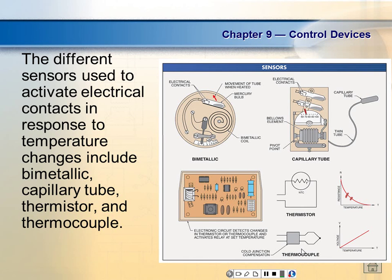Gas fireplaces work the same way — anything with a pilot light will have a thermocouple. If the pilot light goes out, the thermocouple stops generating voltage, the main gas valve closes, and you avoid filling your house with natural gas. To relight it, you'd have to go down with a lighter. If it turned on the main gas without the pilot being lit, the house would fill with natural gas and you could have an explosion.